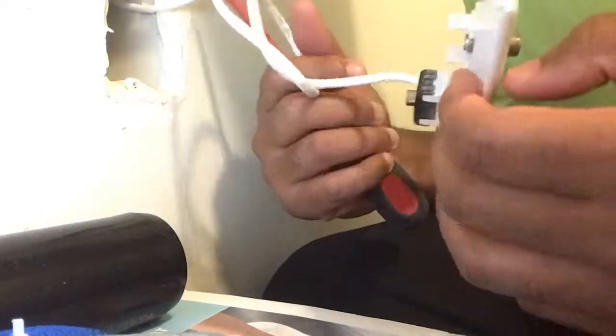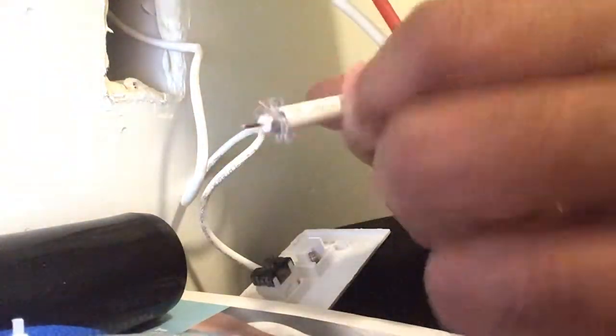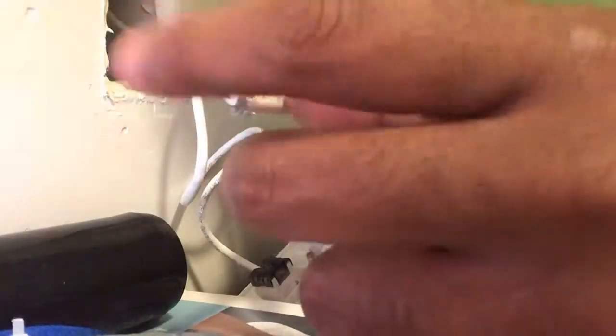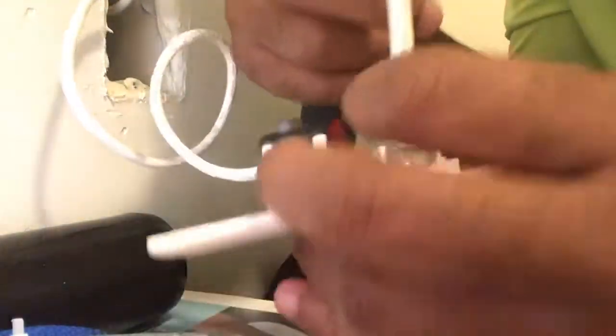On the inside, you've got your Ethernet hooked up in that junction box also. You want to look for the cable — this is a Cat cable, whatever Cat it is, 6 or 5, you can read it. But you're looking for the RG6 cable — this is it right here. If I had fittings, I would put the fitting on here. It doesn't matter if it's like this — a person can just cut a new one. You put a fitting on this and put the tone on it, hook it into here, and twist it in.